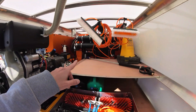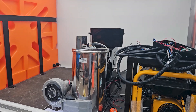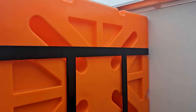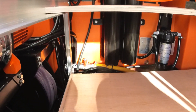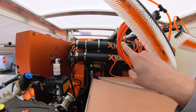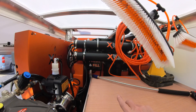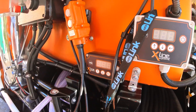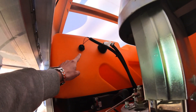Two water tanks — one for deionised pure water, one for tap water — with a total capacity of 1,350 litres. These water tanks can be isolated or linked together with an isolation valve. A five-stage fully automated reverse osmosis pure water filtration system, designed to flush and clean the filter membranes. It also shuts off when the water tank is full.